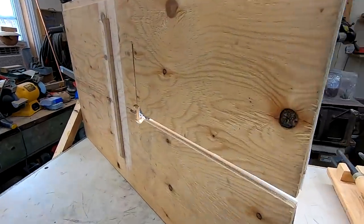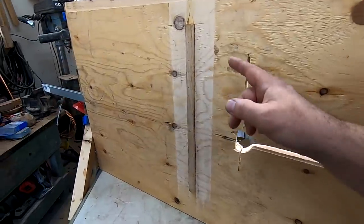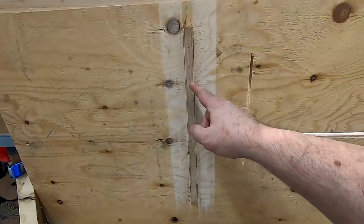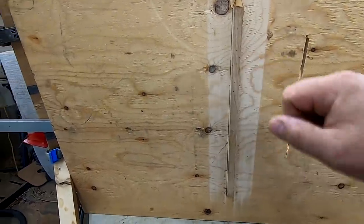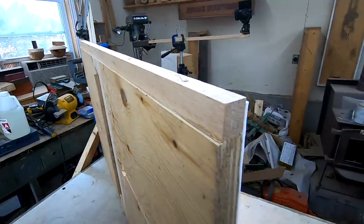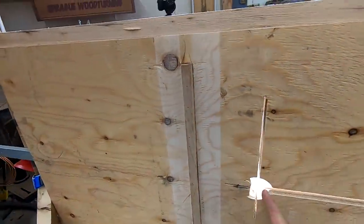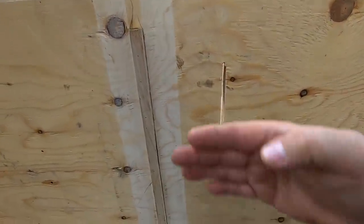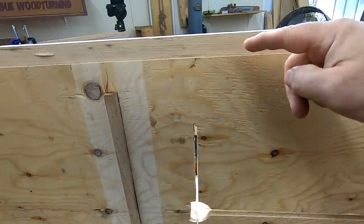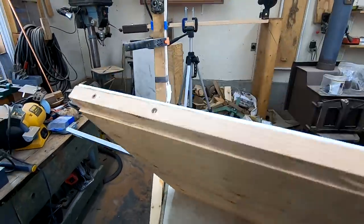This is the underneath — it's a full sheet of half-inch plywood, and this is an oak runner that goes in the miter slot on the bandsaw. Make sure you use a hardwood so that it doesn't wear out, because you do have to move the rig in and out occasionally. I installed this piece of oak on the back side of it to take any flex out of it. You've got quite a cut here, and this was flexing a little bit, so I put this oak runner on there to stiffen it up.